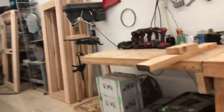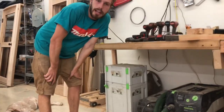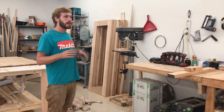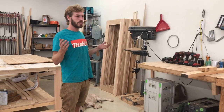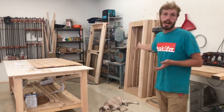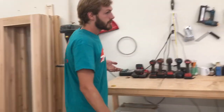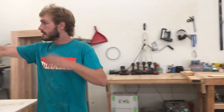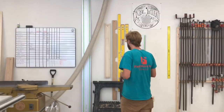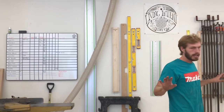Underneath is the Festool zone. Festool is kind of like if Elon Musk created power tools — they're really nice and there are a couple of tools that they have that are just super killer, and you really can't do that process with anything else. Primarily would be the domino joiner, which we use to make all of our panel style doors. Also would be the track saw. Makita now makes a track saw similar, but what's great about it is it's got these several different tracks and you can do long straight cuts. When we're doing the three degree bevel on the bottom of the doors and the in-swing of the doors, it's killer to be able to just line that up and go for it.